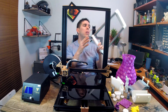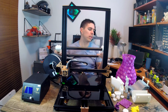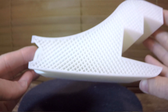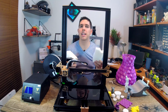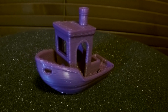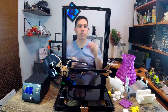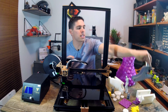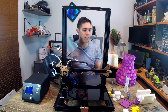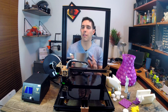I turned attention to a custom project I've been working on. These large end pieces in carbon fiber had trouble fitting on some of my other printers, but this printer did a really good job with very consistent layers. The carbon fiber tube fits perfectly in the end - very accurate mechanically. With a printer this big though, things take a long time to print, so I decided to try a bigger nozzle. I printed a benchy with a 0.8mm nozzle at 0.5mm layer height - it only took just over 20 minutes, by far the fastest benchy I've ever printed. That gave me confidence to print a solid structural part that normally takes 14 hours - it completed in just over four hours. Eventually I'll be converting this printer to a 0.8mm nozzle permanently, covered in an upcoming video.